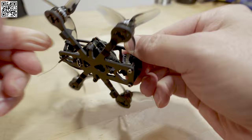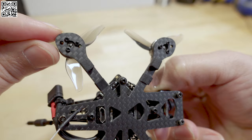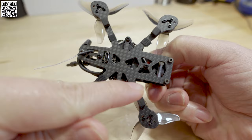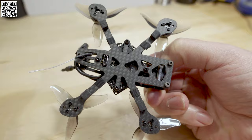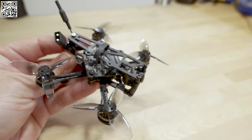This is the HD version with 2-inch props. You've got a 2-millimeter bottom plate — it's a single piece — and you can mount four-screw-hole motors or three-screw-hole motors. These motors use three holes, so it'll take multiple motor types. You can see the micro-USB port coming out of the bottom. It's a 25x25 mounted flight controller board, typically an all-in-one, and it's 2 millimeters thick. The top plate is 1.5 millimeters thick, and you have three M2 standoffs.